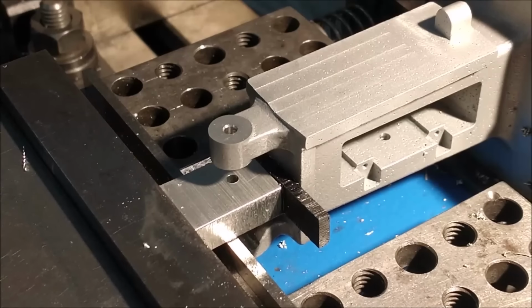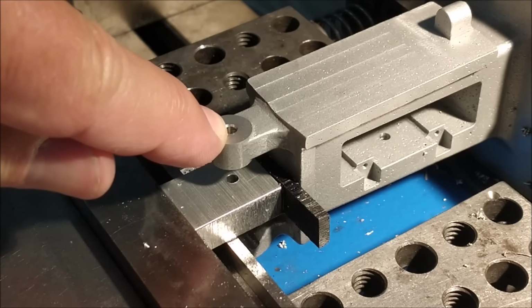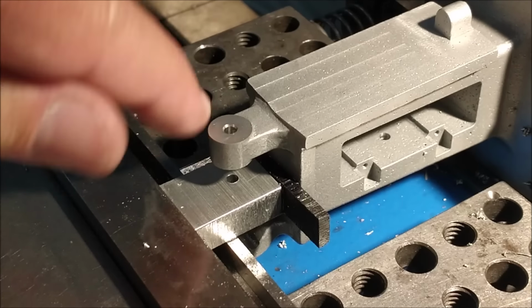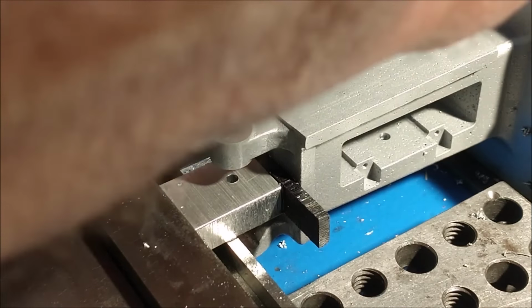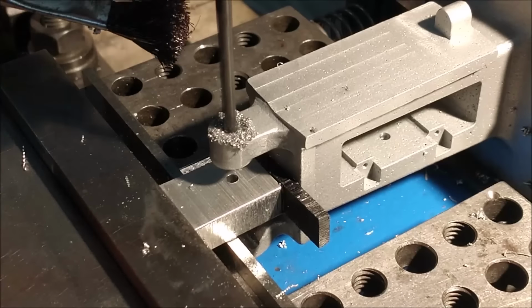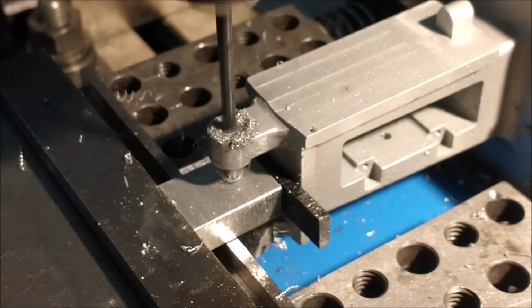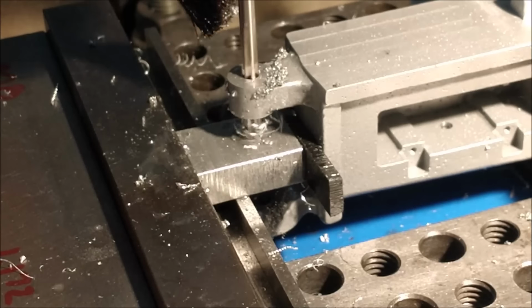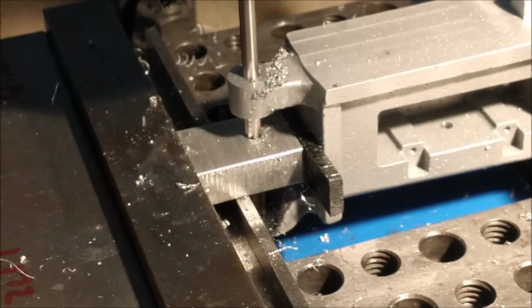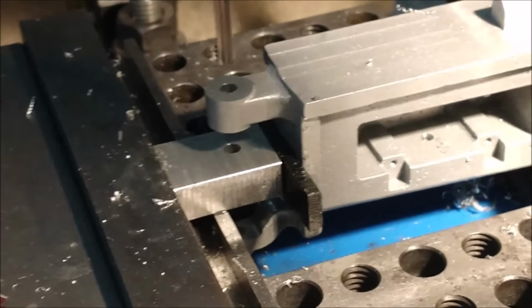After taking a good hard look at the assembly print and some of the sizes of the components and changes that I have planned, I'm making a last minute change here, and I'm going to go to a 157 on this instead of the 125. 157. Now we finish the top to 250, call that feature done.